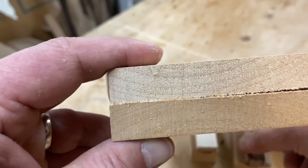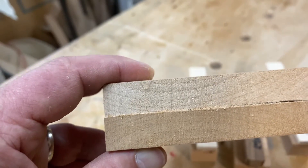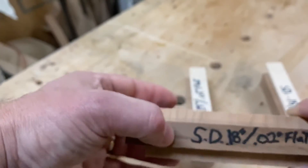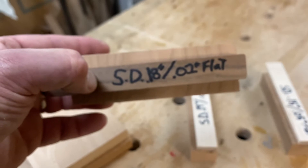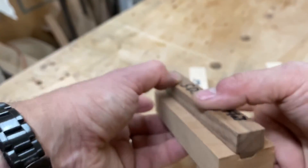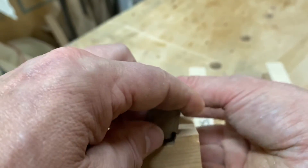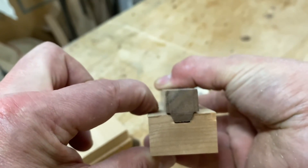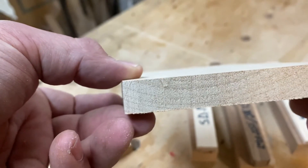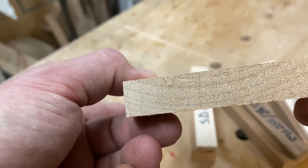Take a look at that — you can hardly find any gap, and that was with a 0.18 start depth and a 0.02 flat depth. So if I'm gluing boards together from this point forward with a v-carve inlay, these are the numbers I'm going to use: on my male piece, a start depth of 0.18 and a flat depth of 0.02. The start depth is where the sidewalls of your male piece come into contact with the sidewalls of the female piece at the top of your female piece. I hope that makes some sense and clears a few things up. I am thoroughly convinced that with a machine that has good tolerances, we'll be able to get really good glue-ups on our inlays with a lot less gap underneath.